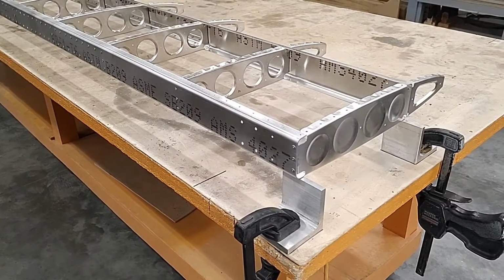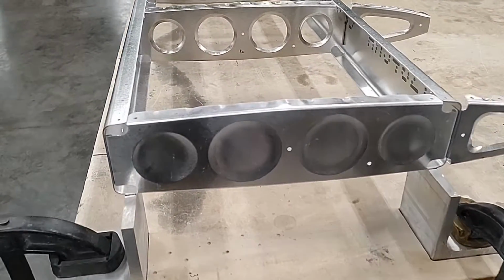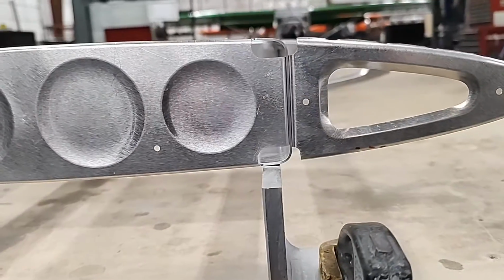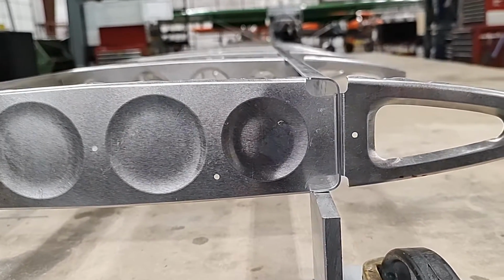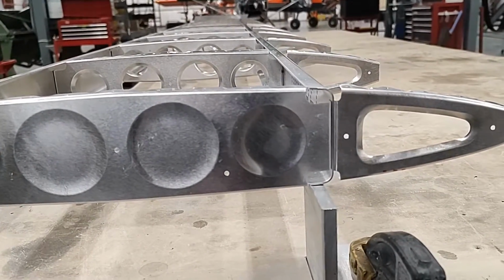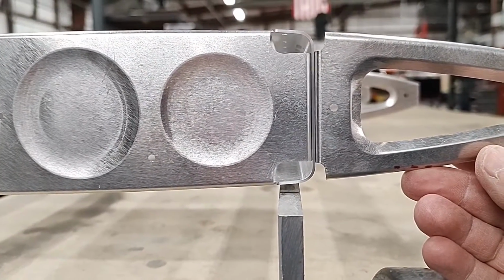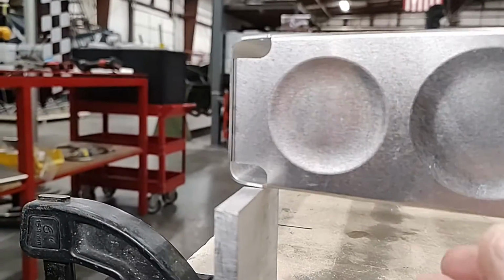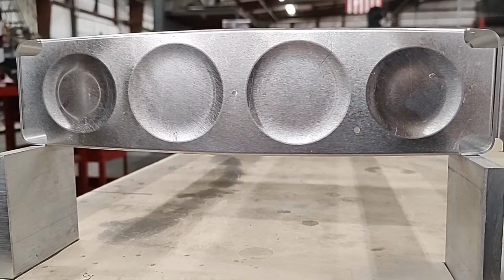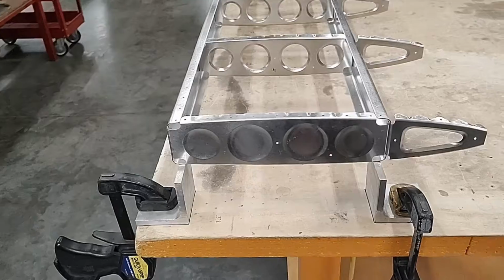But just make sure that those two surfaces are perfectly parallel to each other. Now, placement of those angles is very critical. The spacing is very important. So you can see that I have them right under the spar on both leading edge and trailing edge spars. When we have one side of the skin riveted, it will allow the rivets to just lie underneath the spars, between the angle and the spar, and it will space both sides up evenly, of course, and we still have an even plane on which to assemble this. So honestly, this is the only tip that you need to build a straight horizontal.